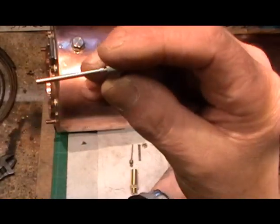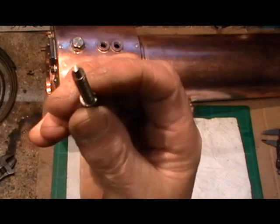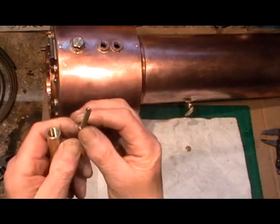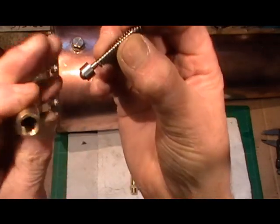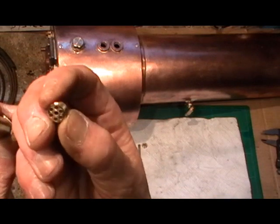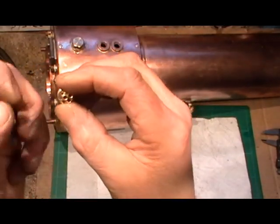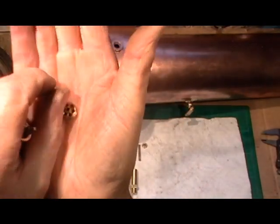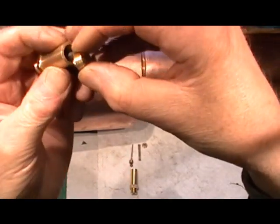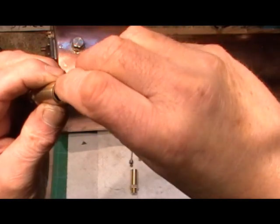The spring fits onto this like so. I may have to just adjust the length of this spring to get the correct PSI, and that fits into the body. I've made this cap out of bronze and drilled holes in it for the steam to release. There's a little spigot on this for the spring to sit on, so that goes down the centre of the spindle and screws into the end.